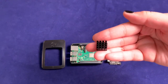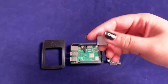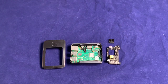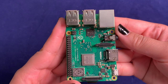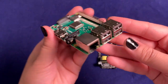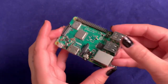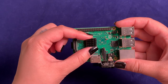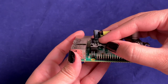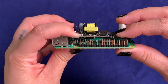Another component that's included is a heat sink. Don't forget to check out the online user manual linked in the description box of this video. For today's demonstration, I'll be using the Raspberry Pi 3B Plus, but there's another video coming later this month using the Raspberry Pi 4. Just a quick clip to show where the heat sink would go. We designed this new PoE Pi hat to be simple to install and set up — all you'll need to do is orient the correct pins on the Pi, then press down fully.